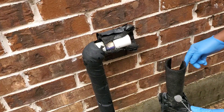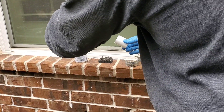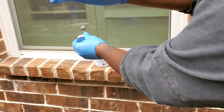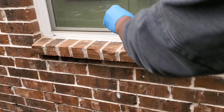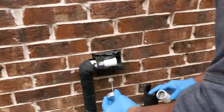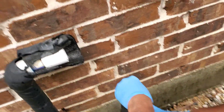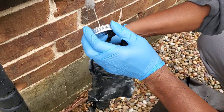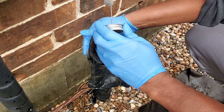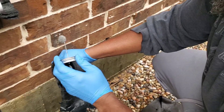I have that coupling right there. Now I'm going to do the bottom piece. I've got my cement — you see the lip and that centerpiece. I'm going to get some cement in there, then get the bottom piece and put the coupling on. I'm going to let that sit for a few seconds, hold it in place so it doesn't push itself out. Then we're going to do the inside of the other side and put the pressure vacuum breaker back on.